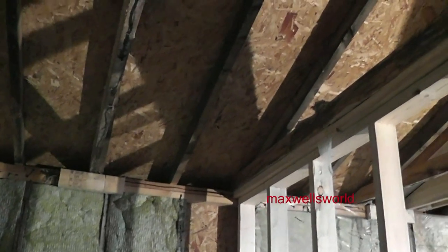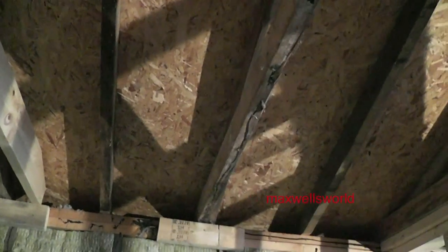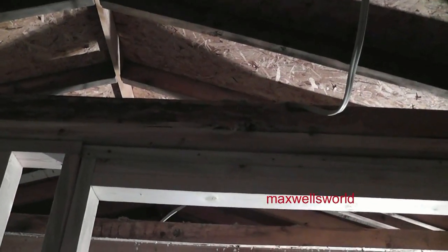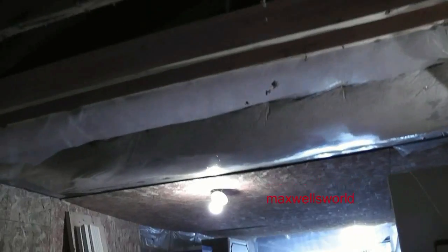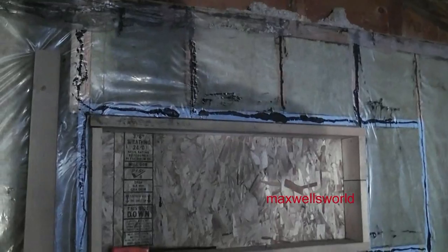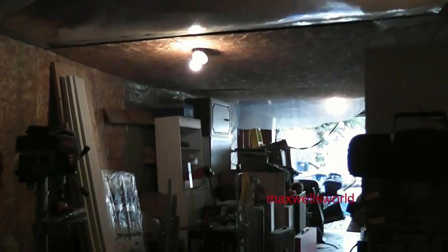The other part of the garage should be framed up the same way and should be within a quarter to half inch of this side. I might cheat and just use a two by four instead of a two by six to sister this up. Other than that, she's going fairly well. I still got to move this wall, pry that two by sixer off, put a few more nails in that stringer, and then stand the wall up. I'd like to finish the night by replacing this window and sheeting it in properly.